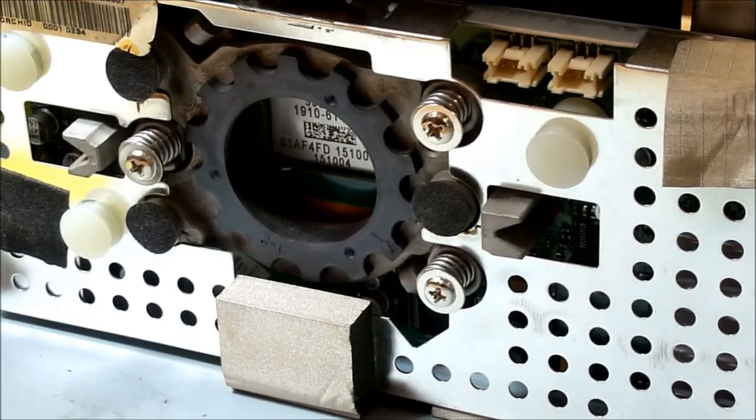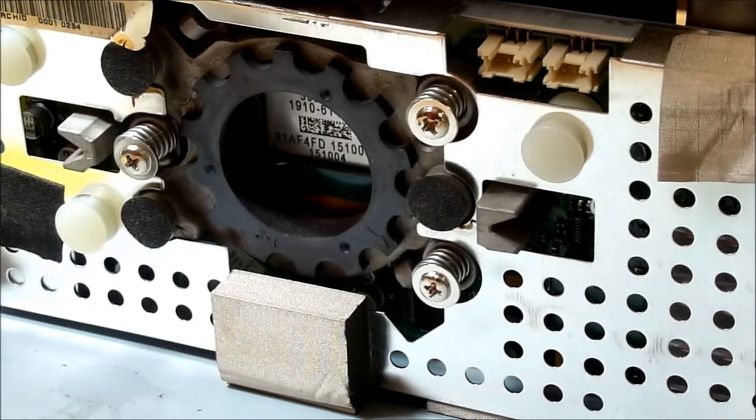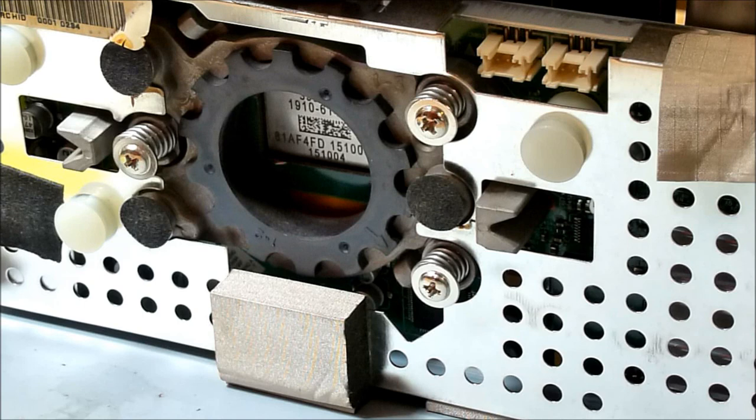So I just thought I'd mention this to you real quick about adjusting the focus. If you do change your DLP chip because of the white spot issue, after you change the DLP chip, the focal plane is at a different height than the original DLP chip was in most cases. So the focus may be off very slightly. You may see some soft lines.